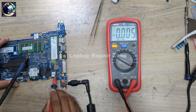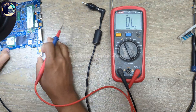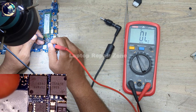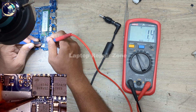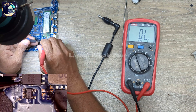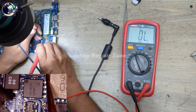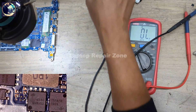So now I will check these four MOSFETs — one, two, three, four. I set my multimeter to diode mode. These are N-channel MOSFETs, so I will check them one by one. The first one is okay, it's beeping; gate is also beeping. Let's check another — it's not beeping. This one is also beeping.